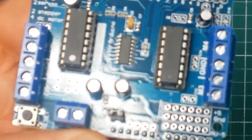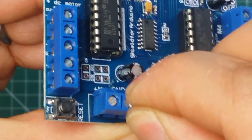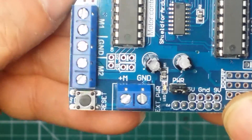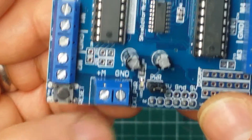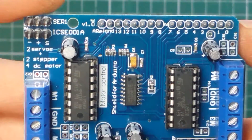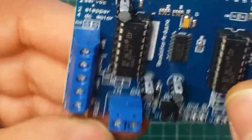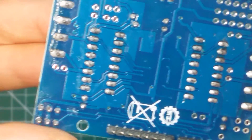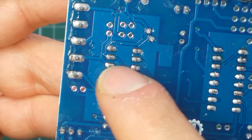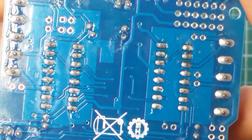The camera is zoomed in — these connectors are very sturdy. This one is a little bit wobbly for the power, but the rest are all okay. We've got a lot of empty spaces for capacitors — three over there, one over there, three more over there, and one more — so why have they left those empty, I'm not sure. The build quality is okay. We've got a lot of ground planes at the top and the bottom, which is a good idea. Those ground pins are mentioned in the datasheet for the IC — this is how you're supposed to lay the track for these ICs.